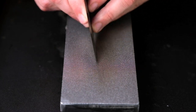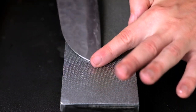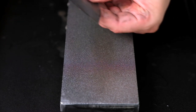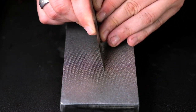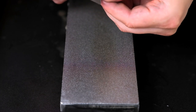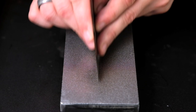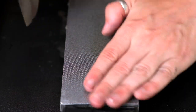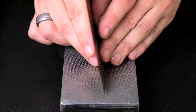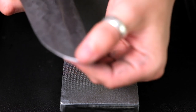Just lightening up on the pressure since we're getting to the end. Not sure if I'll remove all of this permanent marker, but we've done an excellent job of creating a new tip - especially for a first time. This is using an Atoma 140 stone, splashing it here and there when it was getting dry. The biggest point of guidance was really that permanent marker that allowed me to visually see on one side how close I was getting to the objective, and to see on the other side the realization that we just created a new tip.